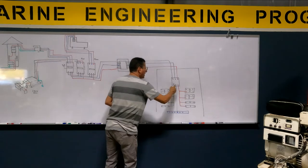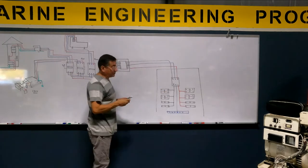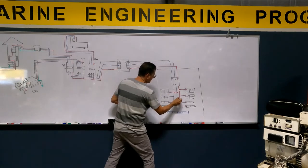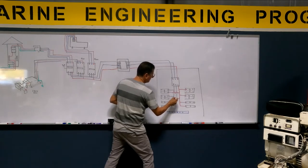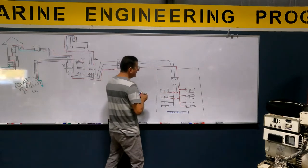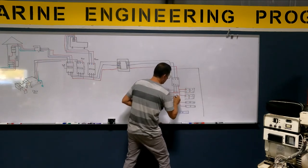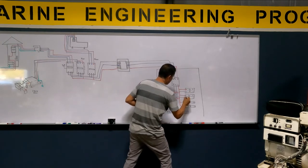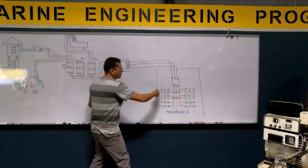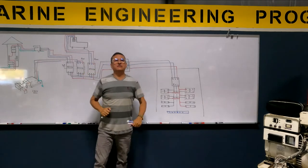I have phase one and I have phase two. But in this breaker I need double phase. Okay, I am going to bring from this one and from this one, and now I have power in both breakers, and the same with the black one. With the black one, one here, and one here. Everybody follow me? And now, both groups of double breakers have two different phases.